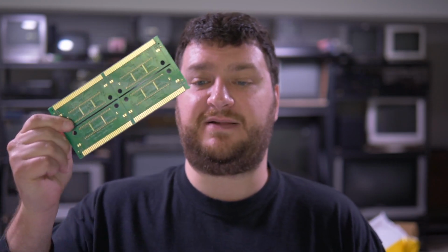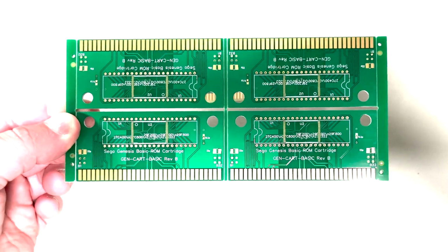And here is the follow-up to the whole beveled edge hard gold for your video game cartridge section. A while back, I had posted a video thinking I got it right, and that was the mistake that I apologized for a few weeks ago. But it turns out that there were a few things that were needed. First of all, in order to make beveled edges, the PCB has to be a minimum size. So rather than make single cartridge PCBs, you have to make them on a panel like this so you have multiple with each.